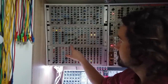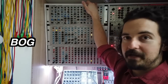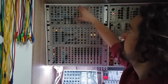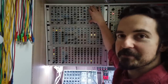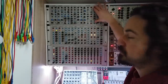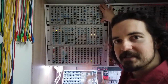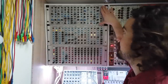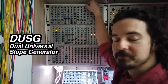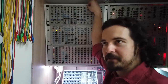The top boat is called 'the Bog' and is basically your voice panel. You've got two oscillators, a wave shaper, a mixer, two VCAs, a voltage controlled filter, a Dual Universal Slope Generator, a voltage controlled frequency divider or clock divider, and a utility LFO — which is not really in the style of Serge but very handy to have as a preset LFO module.